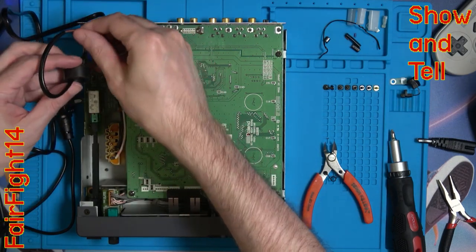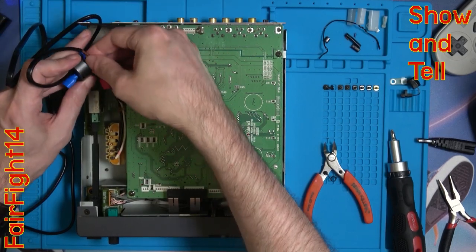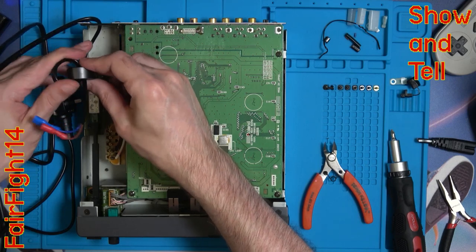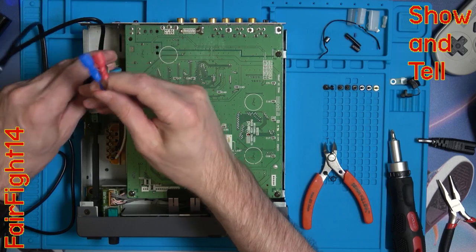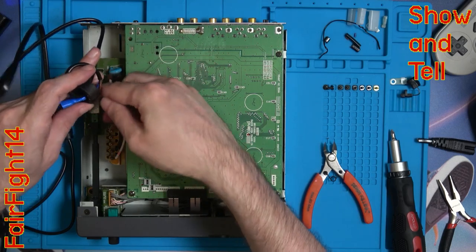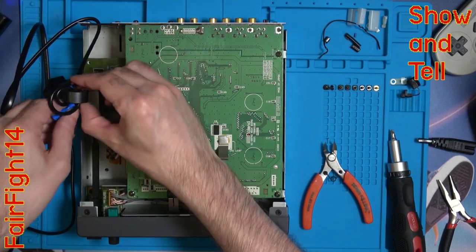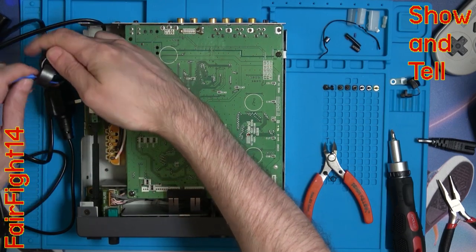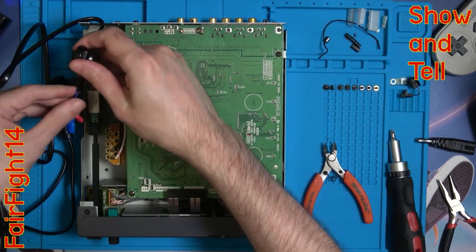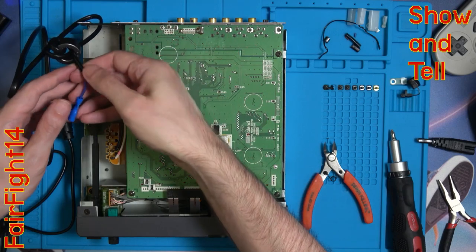At least just enough room. It would have made life a little bit easier if I fed it through the hole at the back of the case, then fed it through the ferrite, and then put on these crimping plugs — so I'll learn from my mistakes and maybe do it that way round instead. I seem to remember it was folded round a few times this ferrite, so I've done it a couple of times. Luckily it just about fits. Make sure that when it's connected to the board it actually lines up with the blue to cold and red to hot — if you've used a tap in the bathroom you'll probably remember how to do that one.